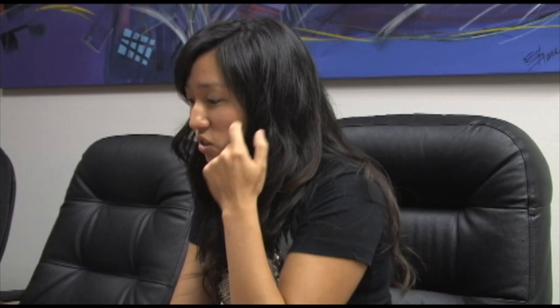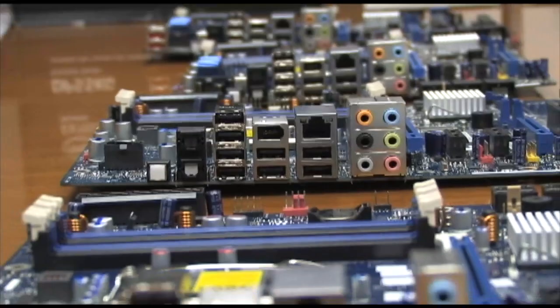Going back to the extreme series, some of the overclocking features we've got here include your normal heat sinks, and we've also included a neat LED light for your post codes. There's a back-to-BIOS switch, which is really neat because it will take you into the BIOS without actually resetting your CMOS — it's not clearing your CMOS. And that will help save you time if you're overclocking. In case you lose your overclock, you don't have to start from scratch. Hours of overclocking saved right there.